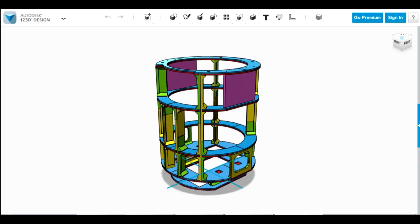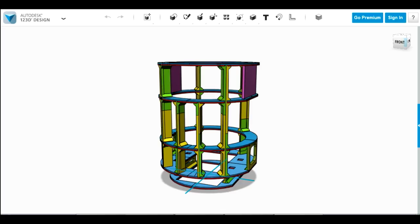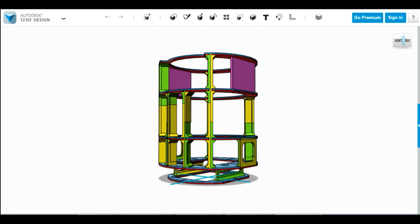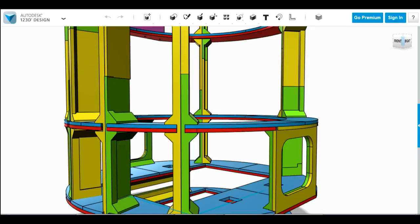With a styrene frame they typically use 5mm styrene, but what I've got here is two 5mm plates laminated together in most places. Looking at one of these pieces you can see a red and a blue piece — two layers stuck together. My frame is going to be twice as thick as a styrene frame but 30% solid, so three times lighter. In fact it's going to be 60% of the weight of solid plastic. I've also got extra tabs on the uprights — these triangular-shaped pieces — to help keep rigidity when there are no skins on.